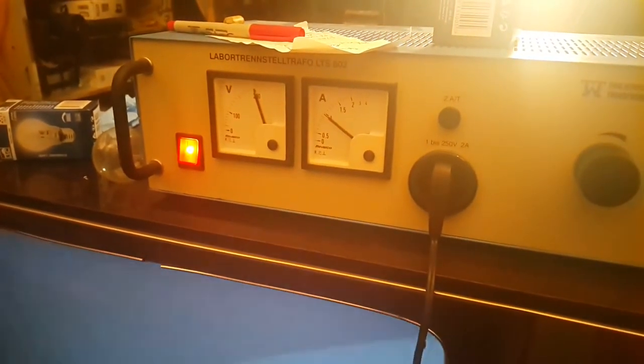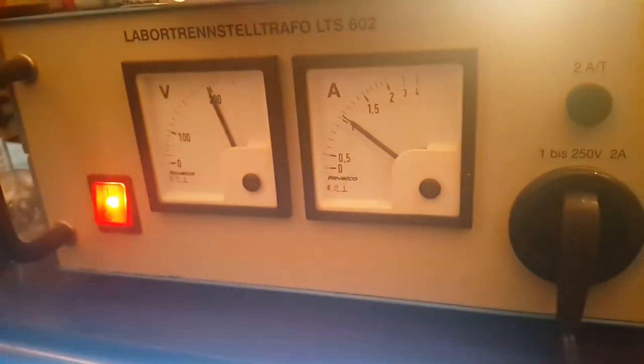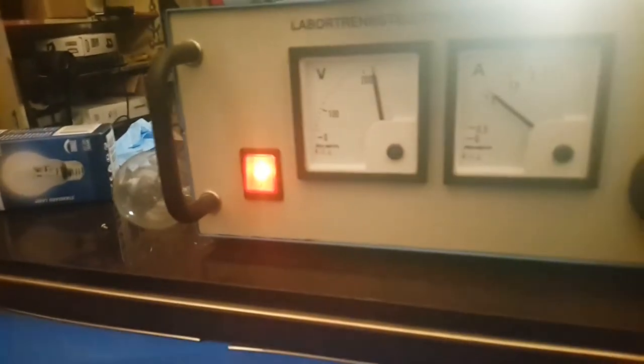Alright, turned it on again. When it starts, it goes up to like 1.5 amp or something like that, and then just settles down, so nothing is terribly wrong, but we're not seeing snow as we would expect. We do have both horizontal and vertical deflection, which is nice. Stay stable at around 1 amp. Give it more voltage, maybe a bit more. And give it 220. Actually, that might be why we're not getting reception. This is more promising. This is very promising, actually.